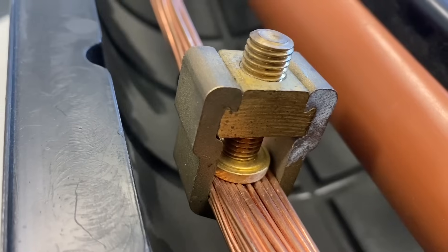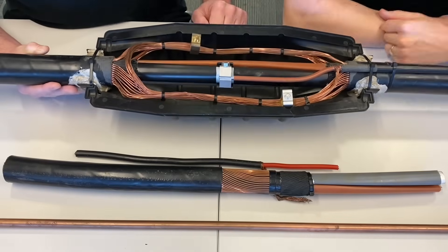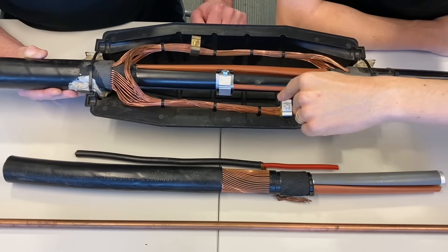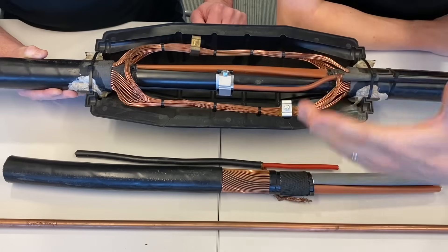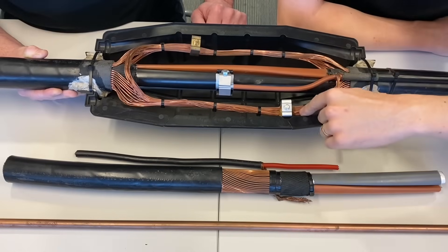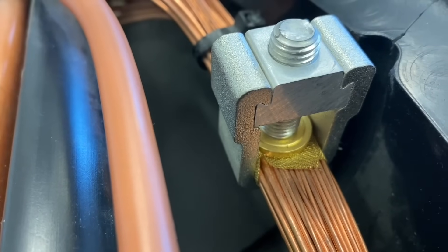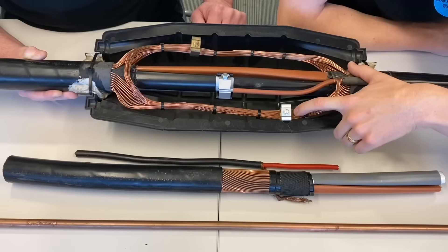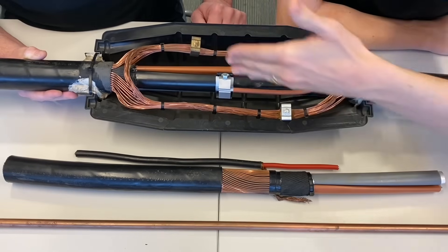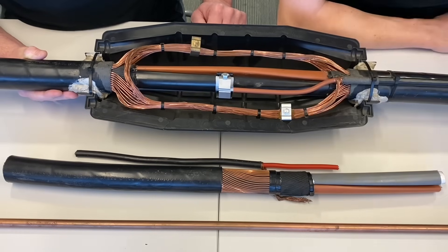It's clamped in two places — double redundancy — and it's also cable tied on, so you're just never going to lose that connection. We've got it on both sides of the protective earth neutral conductor. This one here is brass — there's no dissimilar galvanic reaction between copper and brass, so that's fine. The aluminium clamp was done on purpose. You might think aluminium onto copper means galvanic corrosion, but the little plunger at the bottom is made of brass, and there's also a little piece of brass gauze wrapped around the copper conductors, which prevents galvanic corrosion from taking place.